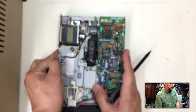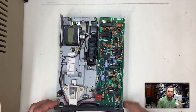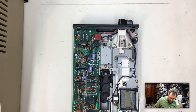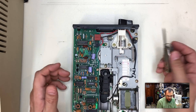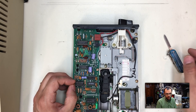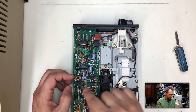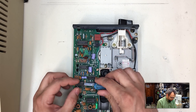Let's go ahead and take that chip out, put a new one in, and see if the drive works. This chip is a 74LS125 — that is a quad three-state bus driver. Bus drivers allow you to drive more TTL loads from a single chip than what that single chip might handle on its own. For example, the 6502 can usually only drive a certain number of loads, and if you need more you put buffers in between so the buffer is driving the load and the 6502 is driving the buffer.